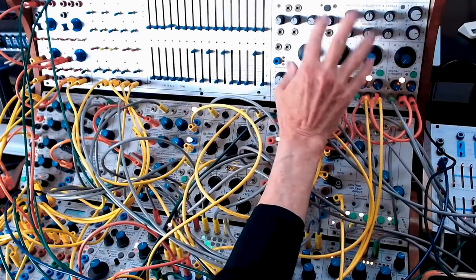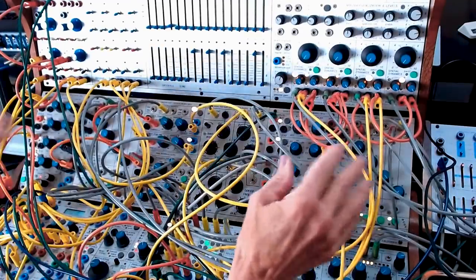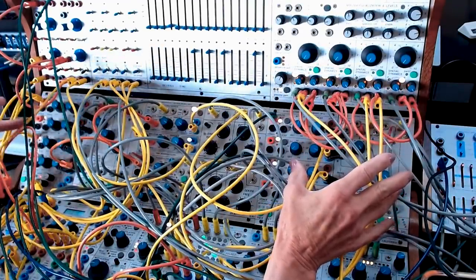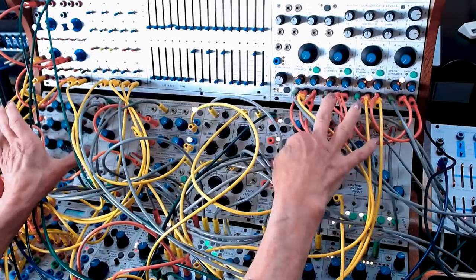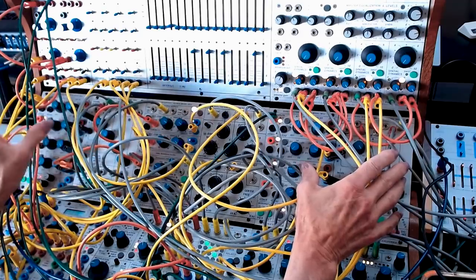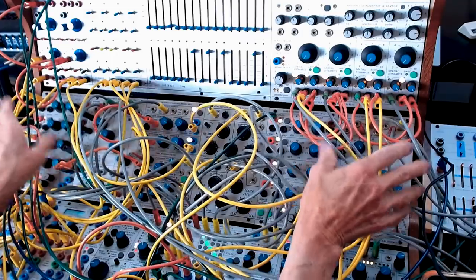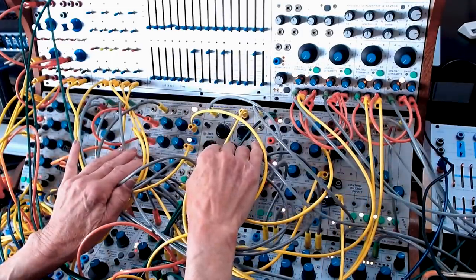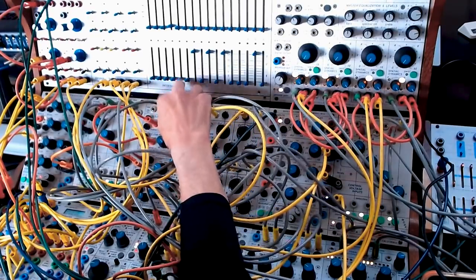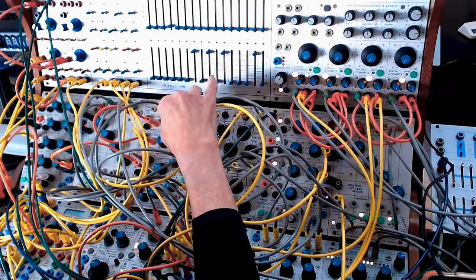This is the 227 — it's a spatial locator. Then in the next row I have a balanced setup: an envelope generator and a gate, and another envelope generator and a gate. I double-gate things. In the middle I have my filters — a 267 filter which includes white noise and a random voltage generator, very compact.